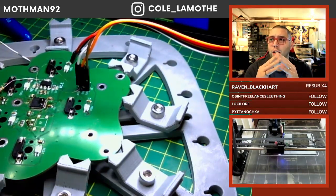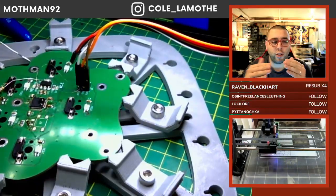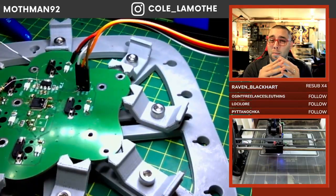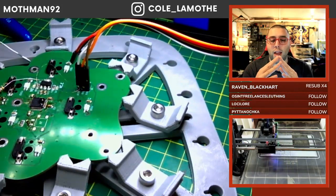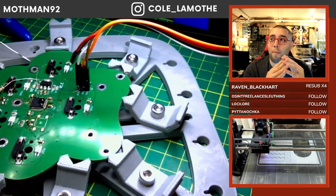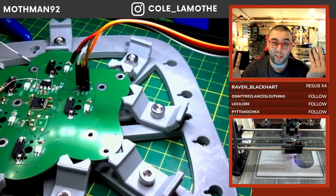If you're going to do boxes, you need to 3D model with your material thickness, because especially for finger joints or bolt joints, your material thickness makes a big difference. If you've got a quarter-inch thick material and your fingers only overlap by an eighth of an inch, then obviously you're going to have problems.